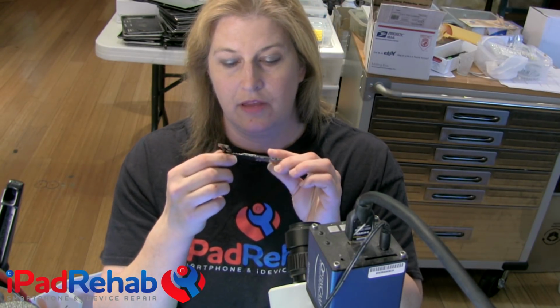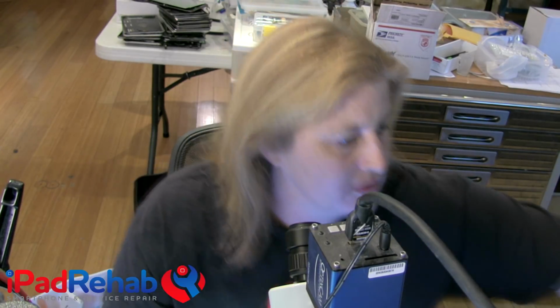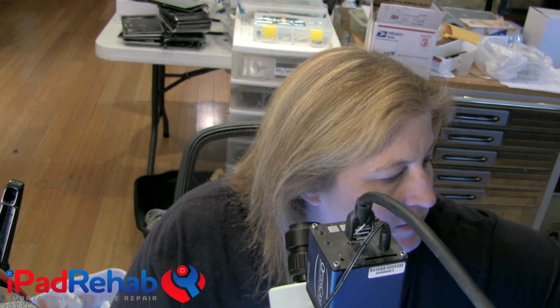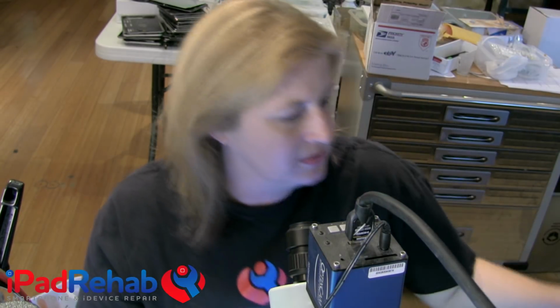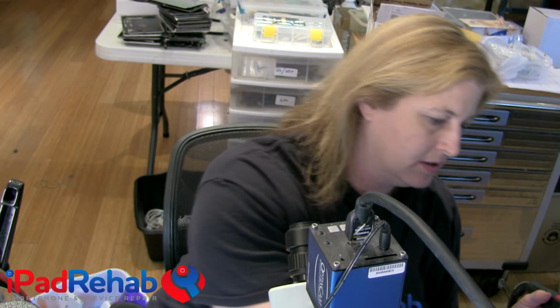All right, so here we go. So here's the board. And the first thing you have to do is desolder the shield. And I've done lots of demos of that before. So I go full heat, full air, full heat on my JBC hot air station. One of these days I'll get around to demoing the quick for you guys.